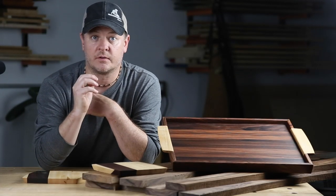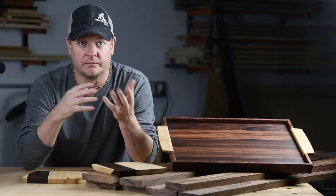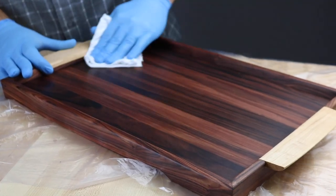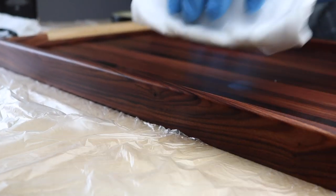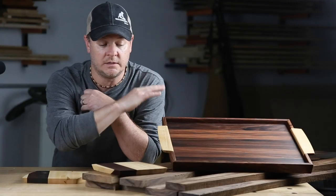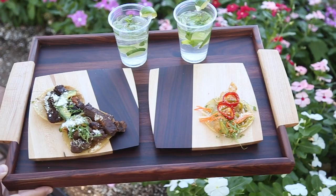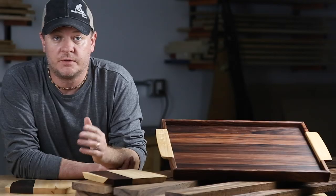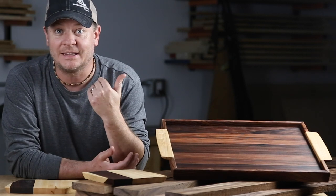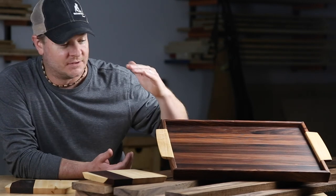In the case of the tray and these two plates, I hit this with Walrus Oil, which is a combination of plant-based oils that are food safe. Then I top-coated it with Wood Wax. For this type of project, that was perfectly appropriate because it's going to come in contact with food and some water. All I'll need to do is clean them off and re-wax them from time to time and they're ready to go. You just can't beat the simplicity of a nice cutting board oil and some wax to top it off.